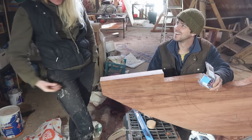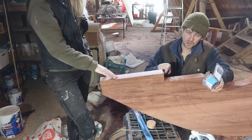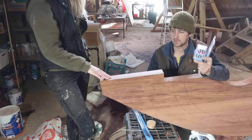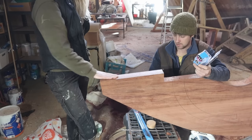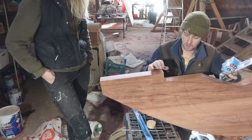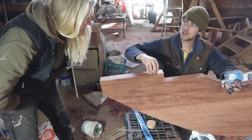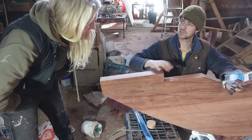How is it usually done? Machined with, we could get the boring bar. I could drill a really big hole and mount the boring bar. But I just want this to be exactly 51mm, and the boring bar sometimes wobbles a bit and takes out more. Oh, because it's on a long pole as well. Yeah. And then we're going to get copper tube and run a copper tube in here. And then the shaft will go through that copper tube and you won't see it.